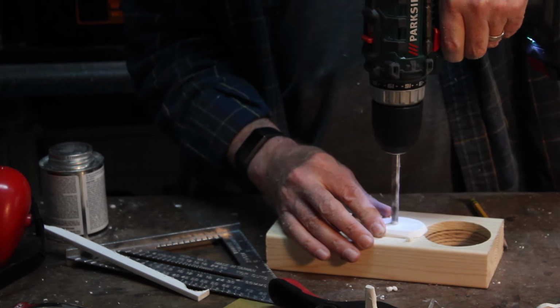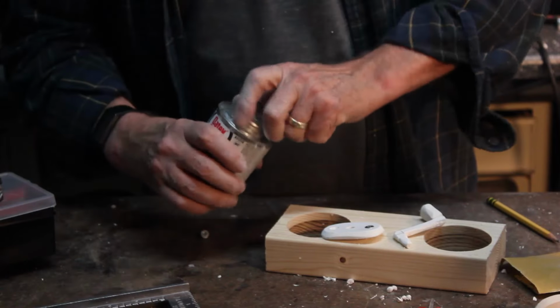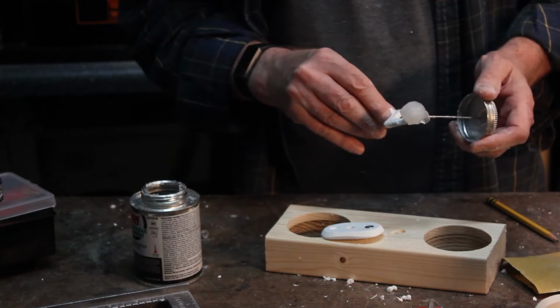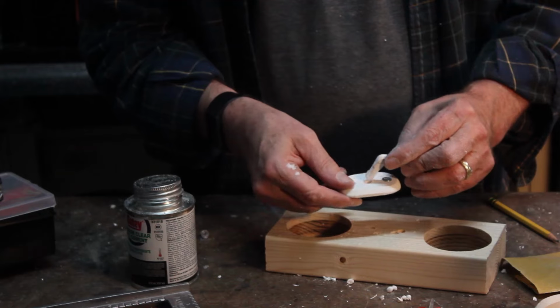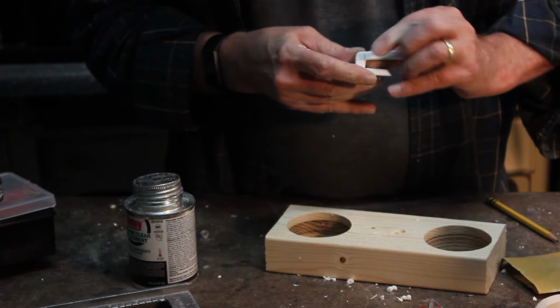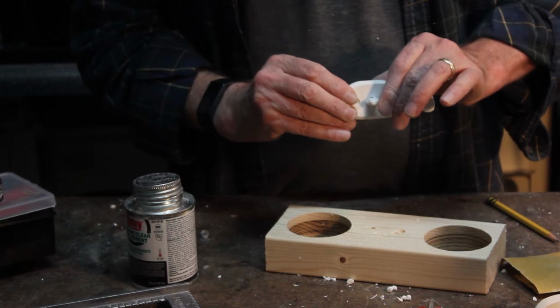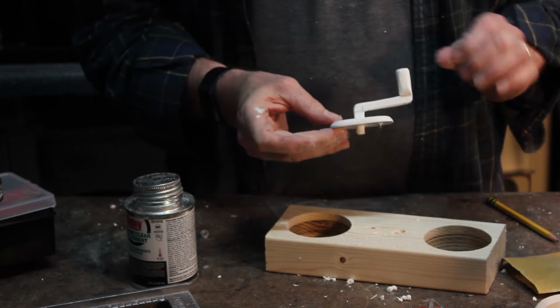I'll build another base plate like the other side, drill that to fit, and then I pre-sunk a couple holes in that and put a short screw on one side because I knew you wouldn't be able to reach it with a glued in crank into that piece. So now I'll take these PVC pieces for both sides and I'll go spray them gold or a brass color.